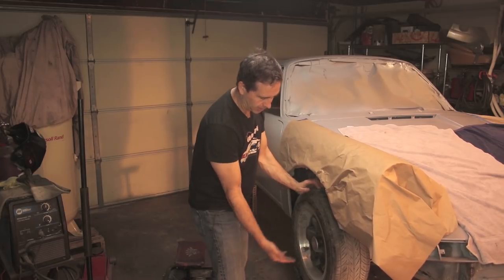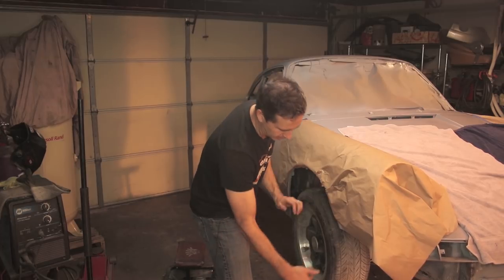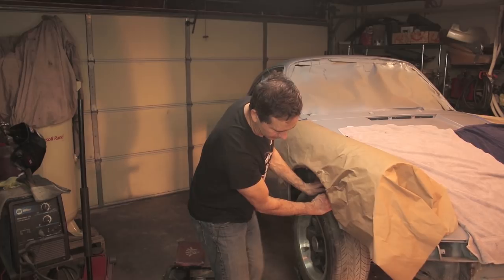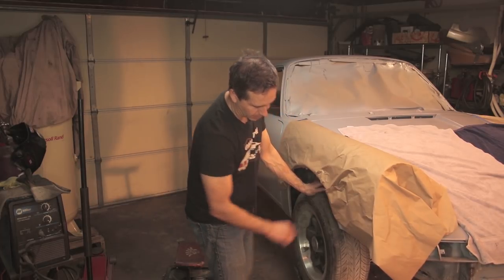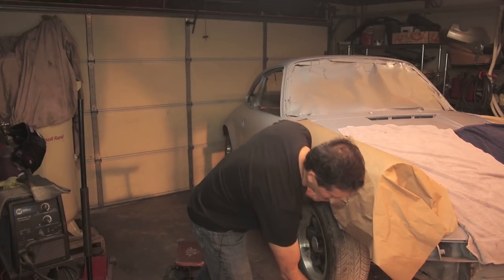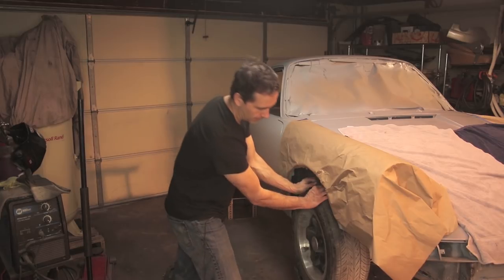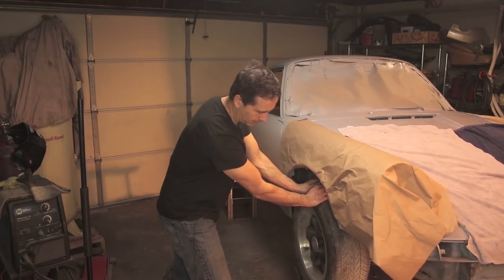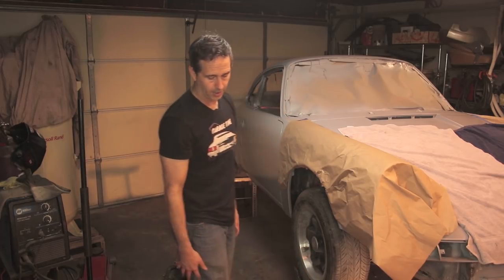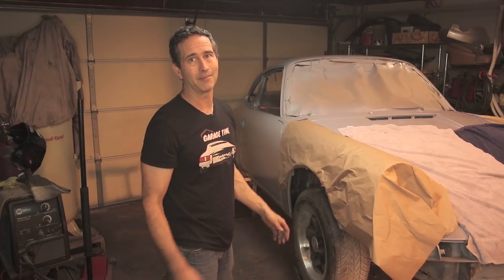And when it is in the fully high position, I am starting to see these uprights move just a little bit. It's actually flexing the base plate. So before I do a lot more on this, I am going to strengthen the base plate on the sides and on the back, just to give it some more rigidity, because I'm starting to see some movement here. I'm seeing some movement in the wheel too, but I'm starting to see some movement on those uprights, and that's a concern. So that needs to be improved before I really spend any time underneath this car.